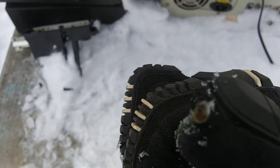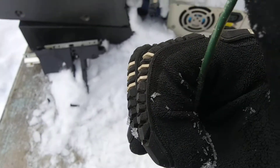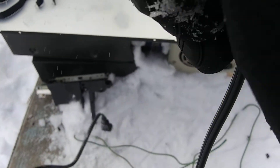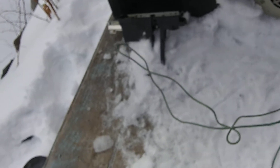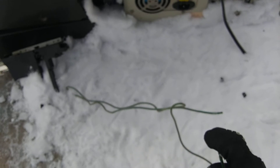This is number one. Basically if you look in there, it's mostly copper — you're going to get very little trash off of this if you strip it. One way to tell that it's number one, or something you might want to strip, is if you can bend it and it holds that bend. Notice how this here doesn't really hold a bend as well — it's just very floppy and droopy. You're not going to want to strip anything like that unless you're just going for the copper. You may even lose money doing it.